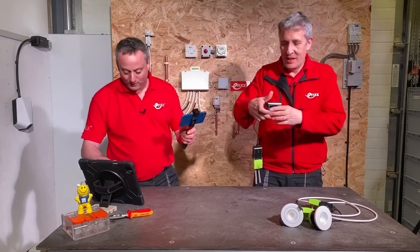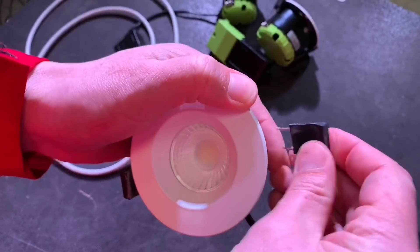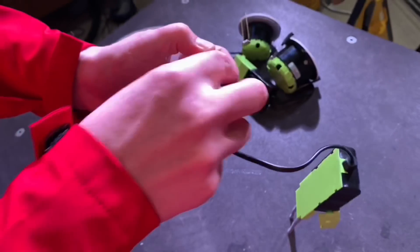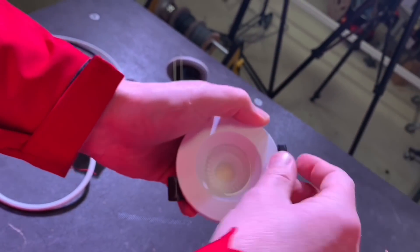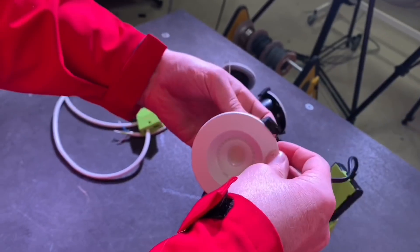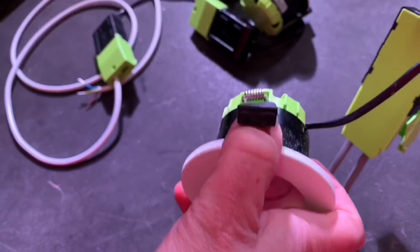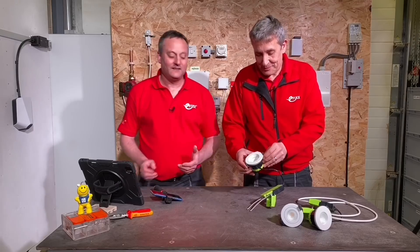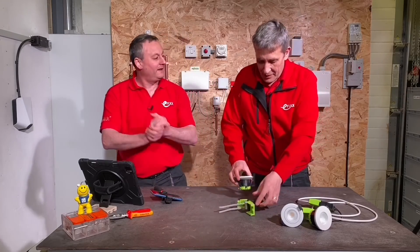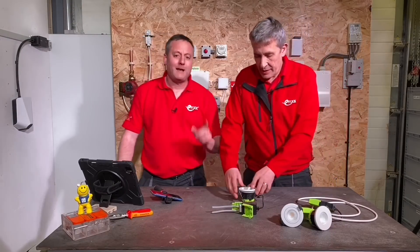There's a little bit of pain involved occasionally when fitting LED downlights, and they've solved that problem too. We've got these little rubber shrouds that go on the end of the springs. That's obviously there to help protect against damage — sometimes these springs can be a bit aggressive, twanging and taking some of the coating off the bezel. But as a good side effect, even if you do something brave, those shrouds protect your fingers too. We took a set off because we had a play with those, and they are painful when they're not on. Manufacturers do think about this — they often leave foam or polystyrene on the springs during delivery, but then the springs catch and chip the paintwork.